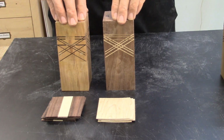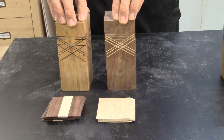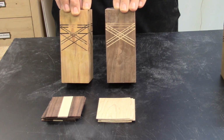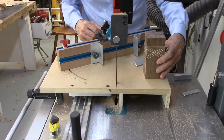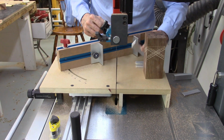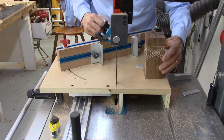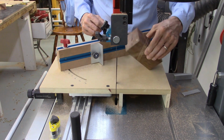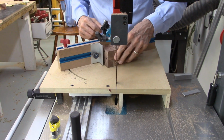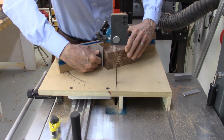However, these 2 blocks will each receive an additional insert to give a total of 16 inserts in each of these 2 blocks, with again different spacing on the 2 blocks. Next block has spacers consisting of a 1/4 inch spacer, a 3/16 inch spacer, which is the last cut, and then an additional 3/16 inch spacer for the final cut. And again, that lines up once again perfect.